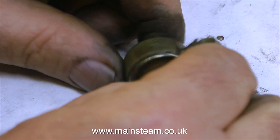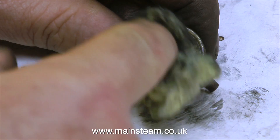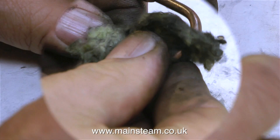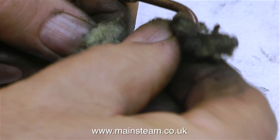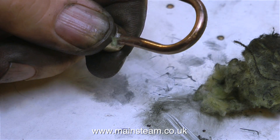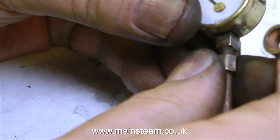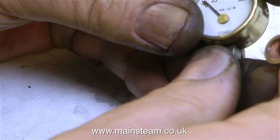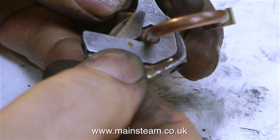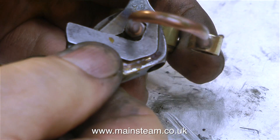It's now time to clean up the steam fittings. I'm cleaning the pressure gauge with a piece of Brasso wadding. I did not put the pressure gauge in the acid bath with all the other components. Here's the siphon from the pressure gauge — it's looking quite clean now. I'm not going to go mad with all these fittings; I do not want them to look too shiny, just clean without any corrosion. A quick note: when you fit a pressure gauge siphon to a pressure gauge, always support the pressure gauge with a spanner and then use another spanner to tighten the nut.